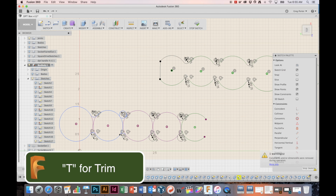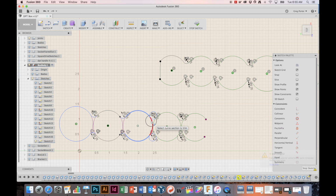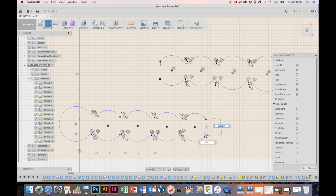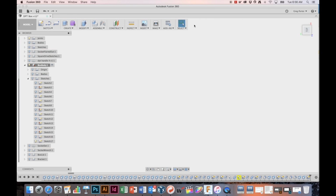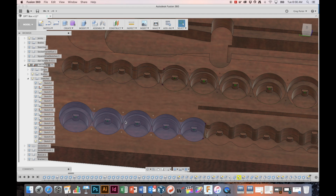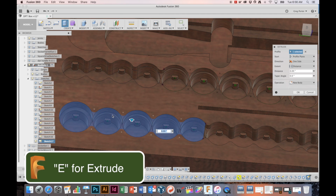And you'll notice all of those red lines will come up from the projected geometry because I didn't delete them yet. So I'll probably go back through here if I had to guess. I can't remember, and delete all of that. Yeah, I did. Good boy, Greg. Keep your drawing clean. So now we have a nice piece of geometry there, and we're going to use both of those pieces as extrusions to cut. So tools to cut the geometry that's already there, just to clean it up.